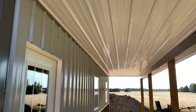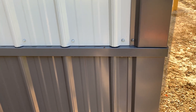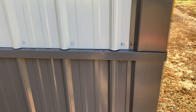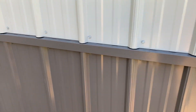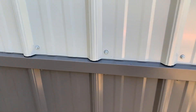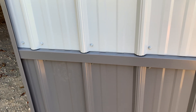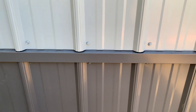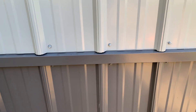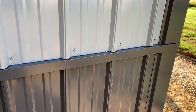Right here we've talked about this in previous videos — the wainscote and how we do this. You want to keep it up just a little bit above, that way you don't get rust. If you do enough of these jobs, the metal companies say if you put it right snug, it'll cause rust — there's no air evaporation to get through there, so there's no place for water to move. That's a little tip for you DIY home builders out there.